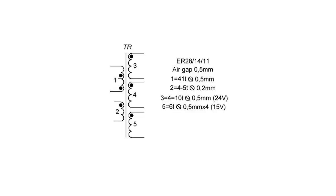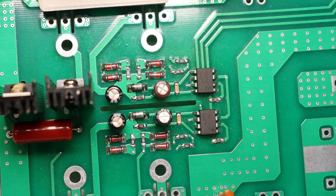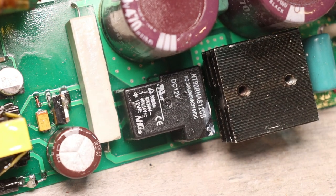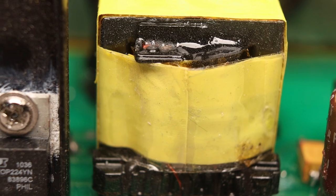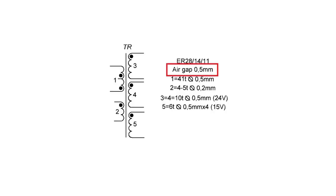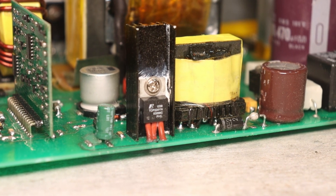Next is the auxiliary source transformer. Full characteristics and winding data are now in front of you. It is worth pointing out that this transformer generates 3 secondary voltages: 2 times 24 volts to power the optodrivers, and 12 to 15 volts to power the control circuit, relay, and fans. The primary winding is divided into two parts; after winding each part, insulation was placed. The topology of the converter in which this transformer — or rather a multi-winding choke — operates is flyback, so there is a gap between the halves of the core which must be calculated. In general, this source is quite powerful — it can provide about 30 to 40 watts.